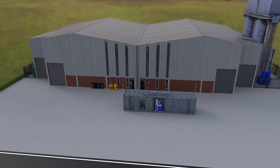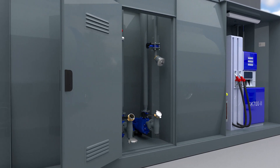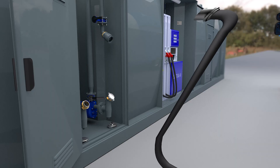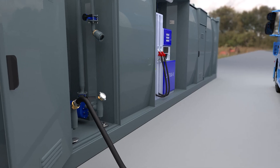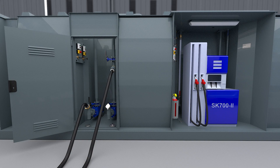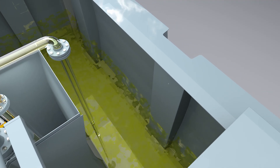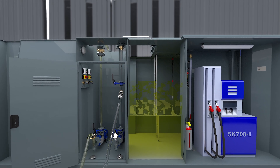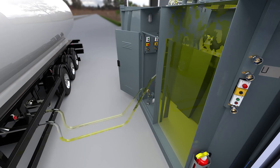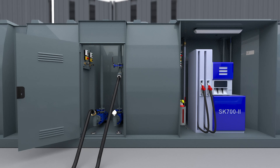This is how the system works. When filling from the tank truck, two hoses are connected: the filling hose to the filling connection and the vapor return hose to the vapor recovery connection. When filling the tank, the fuel-air mixture that is above the fuel liquid is displaced. Instead of leading it out, the fuel-air mixture is returned to the tank truck via the vapor return line. This prevents the dangerous gases that are harmful to health and the environment from escaping.